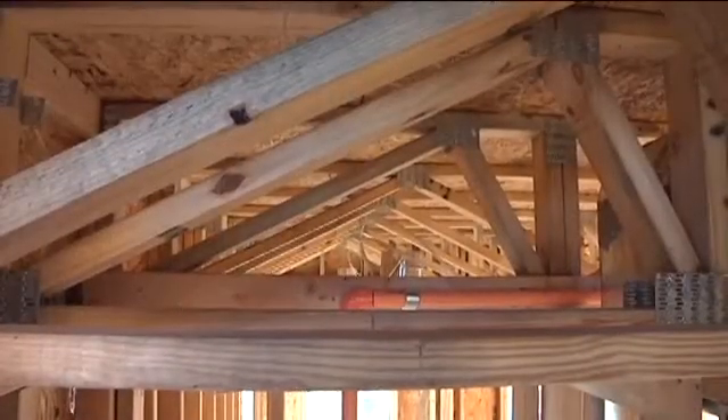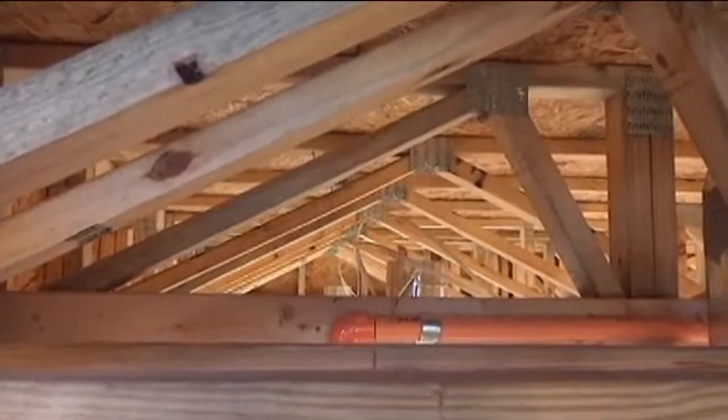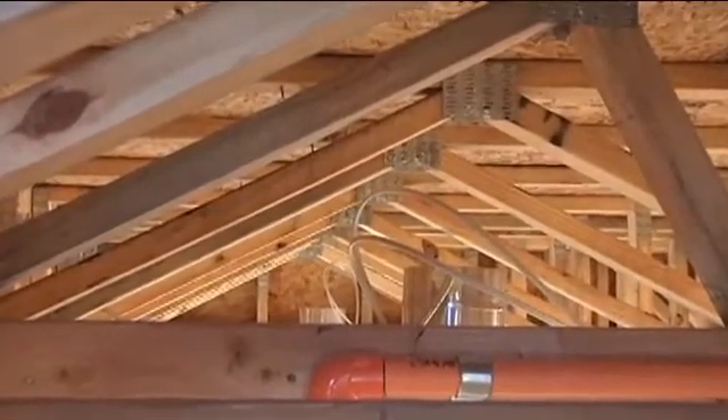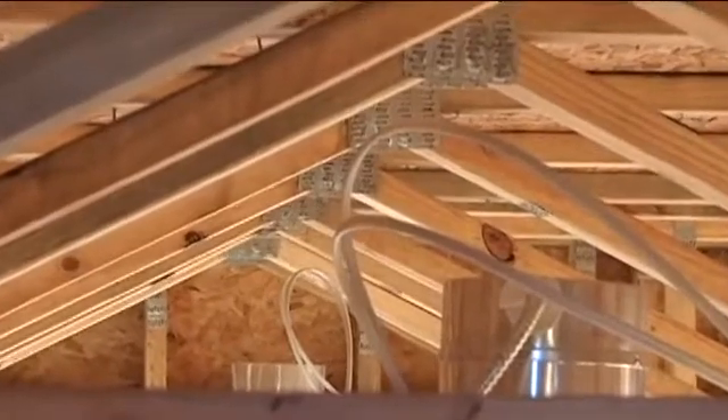This view through the floor truss system clearly details the potential for horizontal fire extension through this area. Also notice the electric utility installed in the truss space. Any mechanical or electrical equipment installed in the combustible void space brings the potential for ignition and fire to occur within that void space. Should fire originate or extend into the combustible void space created by the lightweight peaked roof trusses, it will grow in intensity unnoticed to firefighters operating below. The use of lightweight floor trusses and roof trusses constitutes an extreme hazard to firefighters should fire involve the combustible void space of either the floor or the roof truss. Thank you for watching this session of Fire Engineering's Training Minutes.